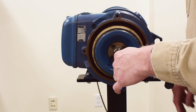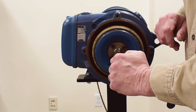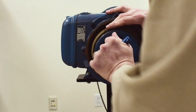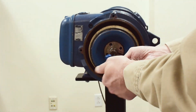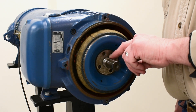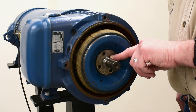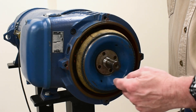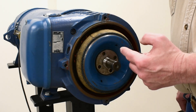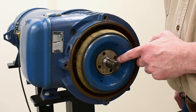Adjustment is accomplished by taking out these four socket head cap screws and removing this disc as the next step. Once the socket head cap screws are removed, I can easily count the number of threads between the end of the threading and the disc itself. This will help in my adjustment — think of a normal brake adjustment as being four holes of the disc, or one revolution. This is right-hand thread, so I'll have to turn this disc counter-clockwise to a new position, and then use the four screws to pull the brake disc out to the position of the locking disc.